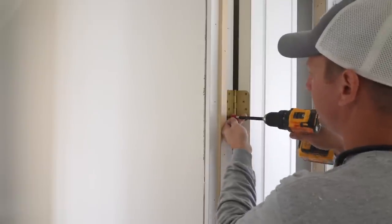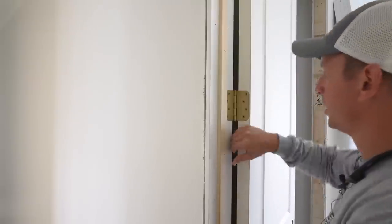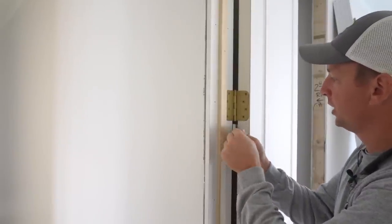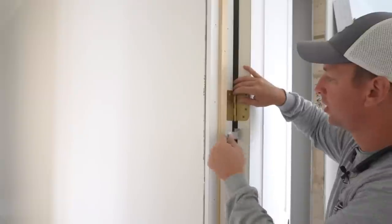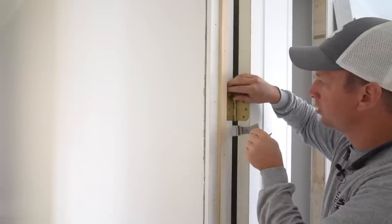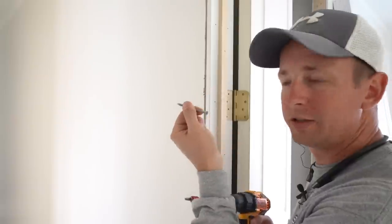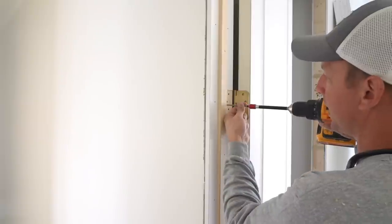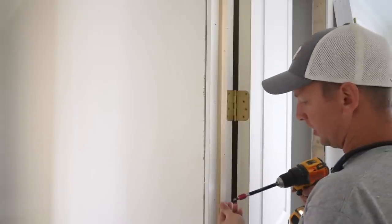We'll go ahead with a regular drill and pop these screws out carefully — we don't want to strip them. Sometimes you'll be trying to get the hinge leaf out, and this is where you can either use a pry bar or a hammer. You just want to insert it between the door and the jam, apply a little bit of pressure, and that will relieve the tension so you can get that hinge leaf out. The same applies whenever you're trying to get the hinge leaf back in place. I use a Phillips head screw so it matches the screws I'm taking out and I don't have to switch drill bits. I want to put the screw where I know my shim is at behind the jam — just get that nice and snug, nice and tight, and that is all we need.